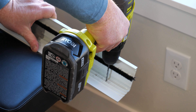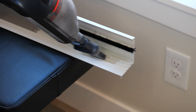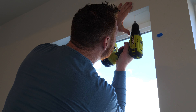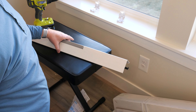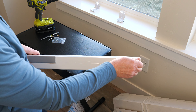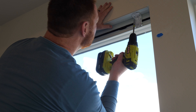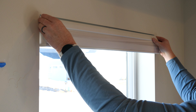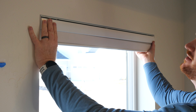I'm going to use my drill bit to pre-drill both holes, then vacuum up the little metal shavings so you don't make a mess. Next, I'll measure and pre-drill the top of the window so the bracket goes in easily, then do the satisfying peel of the plastic on the back. Then I'll place in the four screws, hook the front onto the two brackets, and snap them into place.